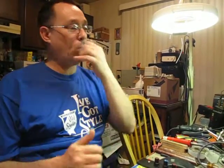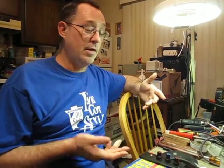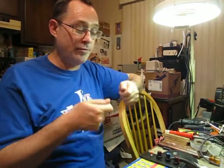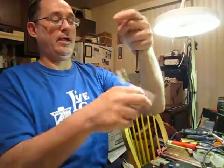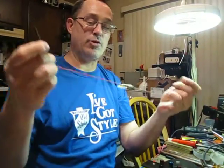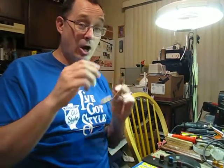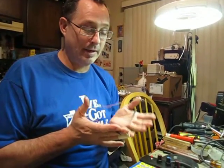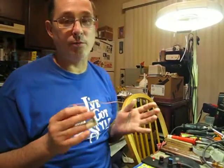This old stuff, when you go in and short it out, it will oftentimes start speaking in tongues. The rule with circuit bending is if you do this, you take the back off the device and you get yourself a piece of wire. This is a good tool. It's 2 nails and with a piece of wire in between, and I have a little 1K resistor, like a low value resistor. So that way, rather than hard shorting these old rare chips and perhaps blowing them up, causing them to fail, the little bit of resistance is going to be enough to let it freak out and speak in tongues, but not hard shorting, risking it to blow up.